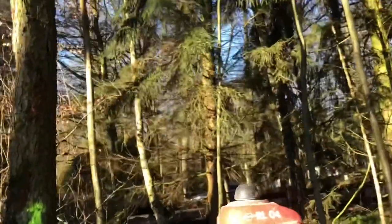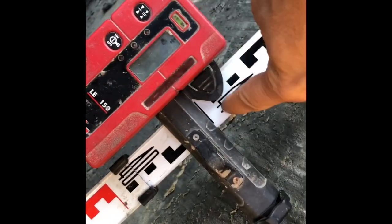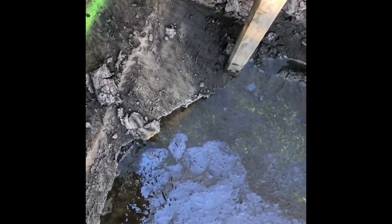The laser is set on the meter, eh? So this means the line of the laser is exactly with the nail I put, which is the meter, eh? Okay, so that's 4 meter 10. From the meter level, so that's 3 10, eh? Downside of the plate. Let's see what we have. So I put it on the water and I just see, do I have a reading? No. Try to go down, I have a reading. So this is too high. The level we need.